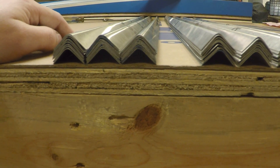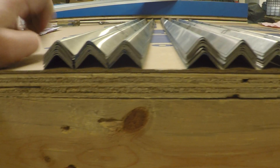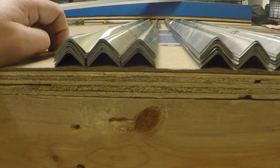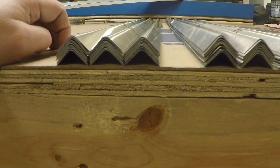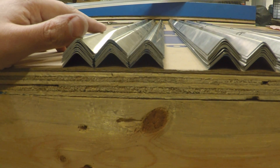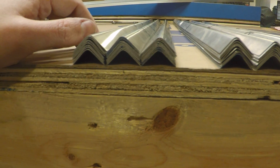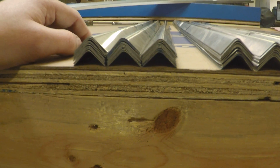The easiest way to do this is just to start with a four by 12 sheet, start cutting L, cutting your 36 millimeter wide strips, do them maybe 10 at a time. You're going to get hand cramps. I'm manually filing them — unless you're using a better deburring method — but I found the quickest way for me was to use a Vixen file and go up and down the length a few times to deburr it. It actually didn't take very long, but it's about an hour and a half to two hours for every 10 pieces.